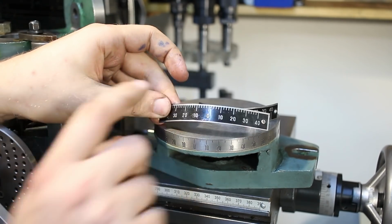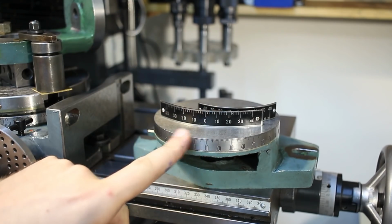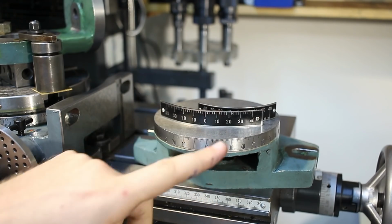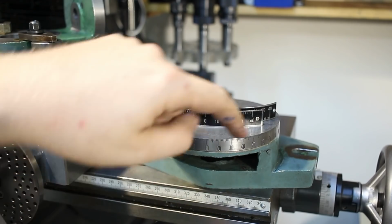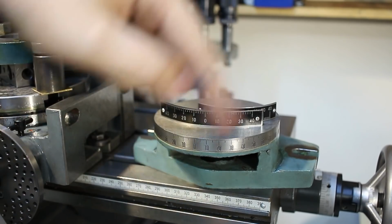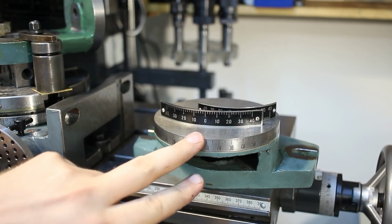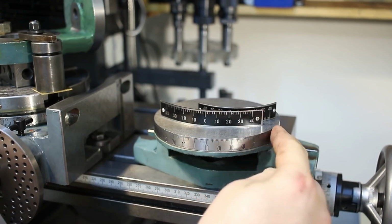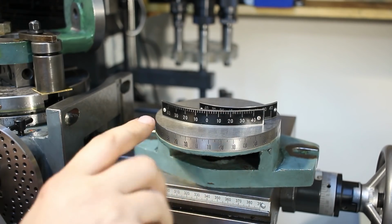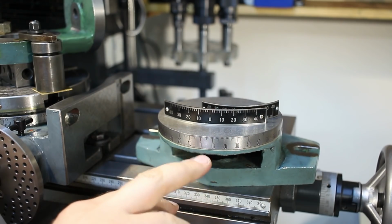So I chiseled these off and I machined a round reference surface on. This is the base of the motor driven workhead. I machined a round reference surface on the rotary table, just with an end mill all the way around, and then I used the milling machine to shape plus minus 90 degree markings on there, and then I took the whole setup over to the engraving machine and I cut the numbers.